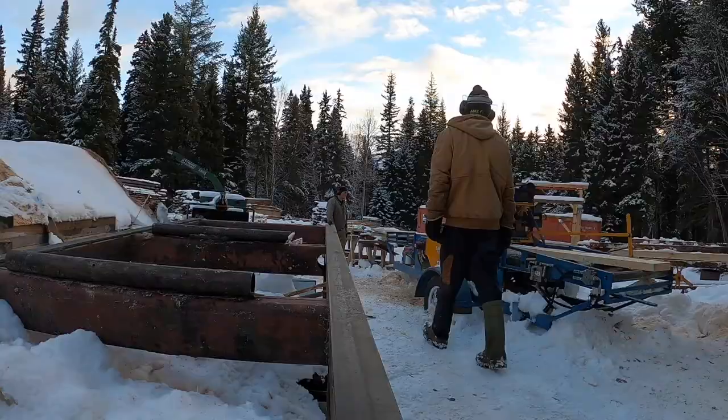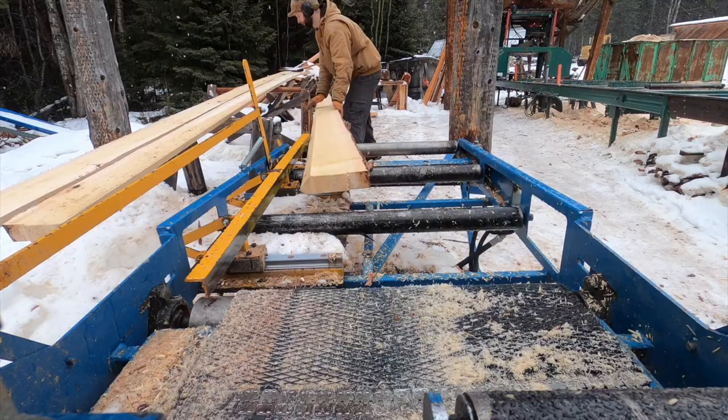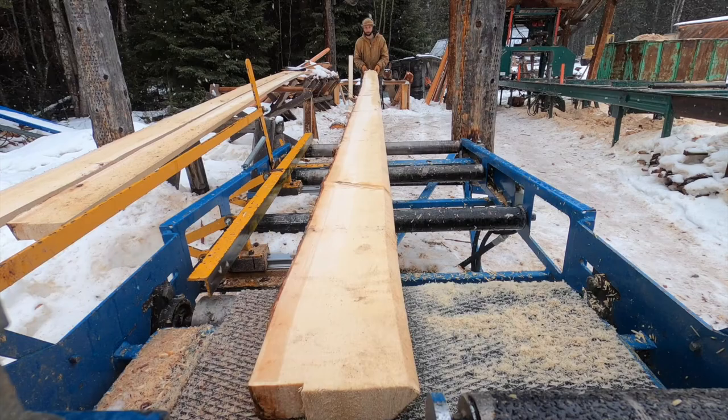While the band mill is breaking down logs, the 2-inch is being reprocessed at the edger. These wide pieces, up to 16 inches wide, are being reprocessed down into 4- and 6-inch lumber. Those of you who are familiar with edgers will see that the fence is not being used on this cut, and you might wonder why.